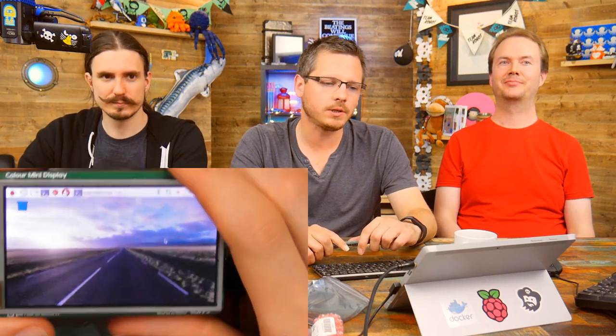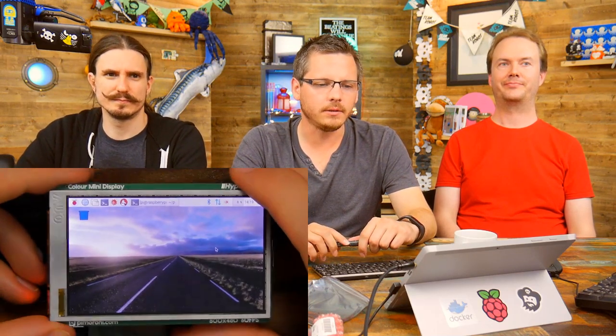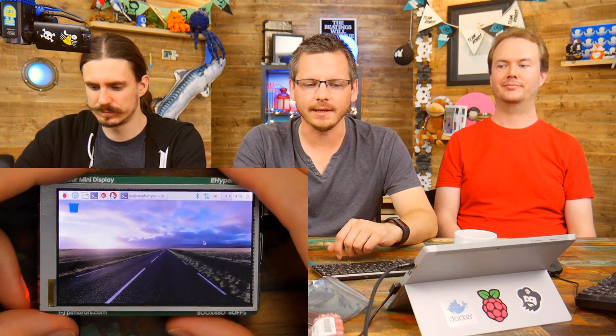Very nice. It's £40, which is, I mean, these kind of screens tend to be roughly that price point. The reason we like this one particularly is the high resolution and high frame rate, which you just can't get through an SPI screen. Effectively, we're pushing about 4 times the pixel data of the SPI screens, so it's just not possible to do it via SPI on a Pi.